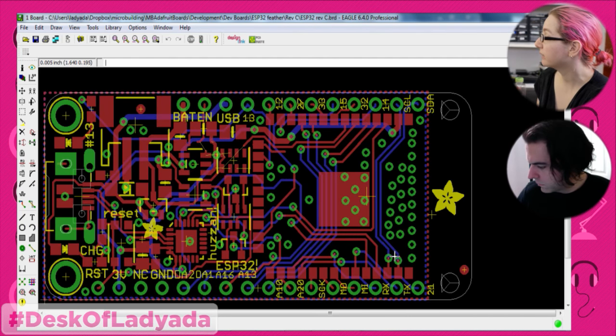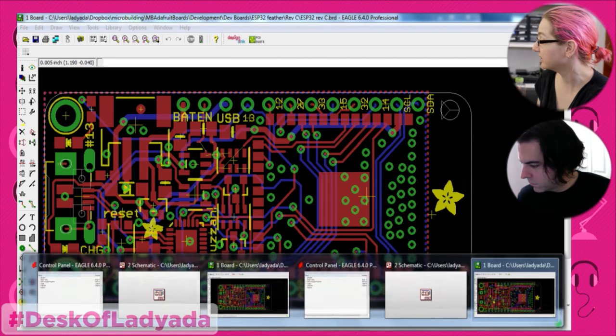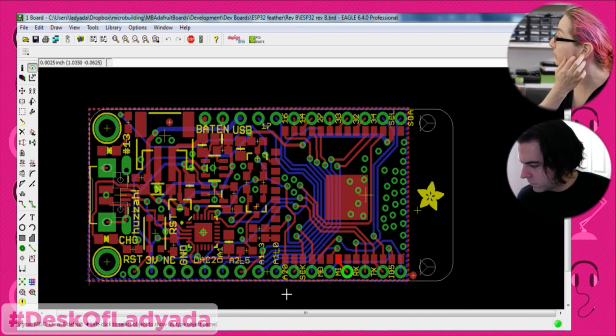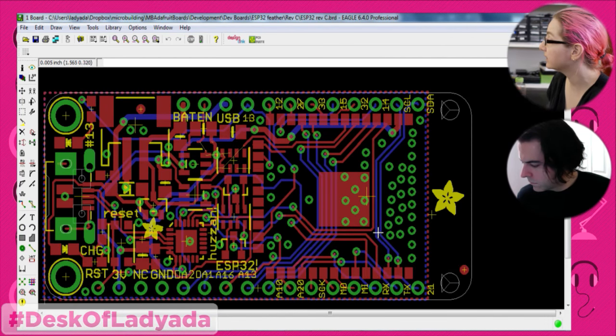I cleaned up this routing so you can rearrange which pins are I2C. And you can see that this is nice, these two parallel lines here, whereas in the old version, there's this little roundaboutness. They cross over each other. So because you can pin mux whatever you want, why not make it clean? Made it nice and clean.